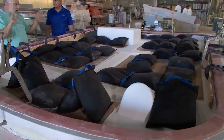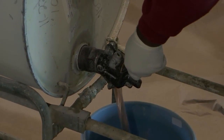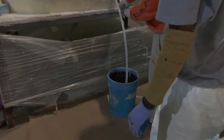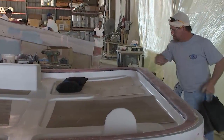We're only making one of these, so naturally once the mold's made you spray in the gel coat, then put in the glass and the core material. A different technique was used for the resin — it wasn't hand laid up. This was vacuum infused. The advantage is it's lighter, it's stronger, it has a better resin-to-glass ratio, and it's just a better overall product. How many boat builders do you work with? Hundreds — the lion's share of boat builders out there have, one time or another, had us build their tooling.